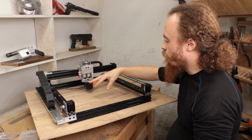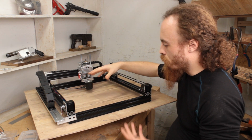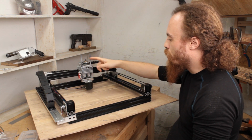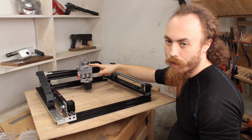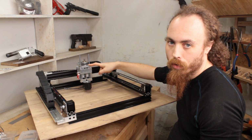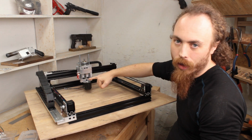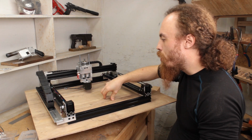The Z minus switch is going into, like, I don't know where. It's going to be per run, depending on exactly where the workpiece or what it's standing on would be. I don't know exactly where it's going to bottom out. So for Z minus, I'm just going to use Grbl's built-in soft limits and not have a physical switch. I googled it and that seemed to be what everyone does who has an actual full moving Z base rather than a standard linear slide up here. So I don't think it'll be a problem. It seems to work for everyone else, so I'm not too worried about it.